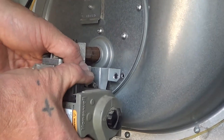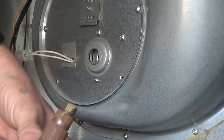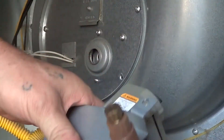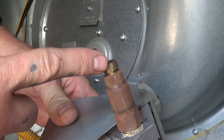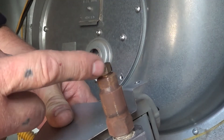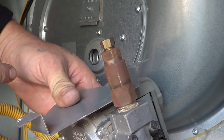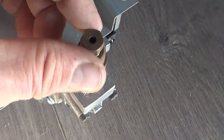The piece that we're looking for is this piece right here — this is the orifice for the furnace. On this Intertherm furnace, most often that's a 7/16. On Coleman that's often a half inch. This is the piece we're going to take off and look inside of to see what's going on. We've loosened this and we're going to take it all the way off.